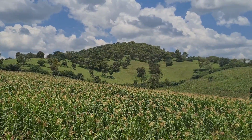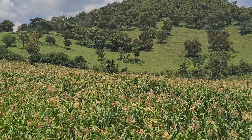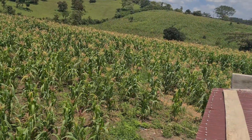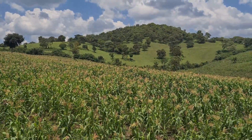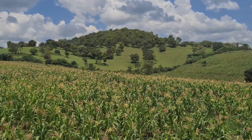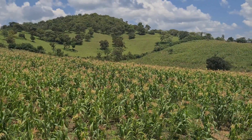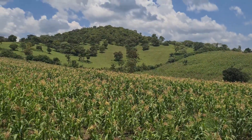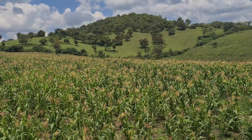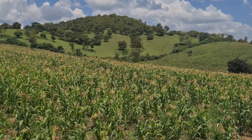We are pumping water up to that hill — that is where our reservoir is. The vertical height, meaning the straight-line vertical distance from the water source up to where the tank is, is 70 meters. On top of that you add about 2 meters of tank height. The well has been dug to 100 feet; that is the water level, and the top 20 feet covers the water.